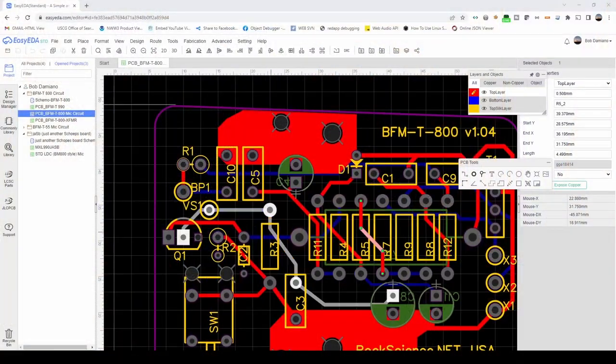Later came some transformer-coupled designs. Transformer designs are all over the map. I could have done a straight-up U87 clone or something like that, but I decided to go simple and do what many have done before me and base my circuit on the Neumann KM84. This is the circuit from the famous Neumann pencil mic, adapted for a large diameter capsule. It's a very simple design — between the capsule and your mic preamp is an FET, a capacitor, and a Cinemag transformer. And that's it.